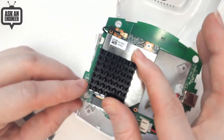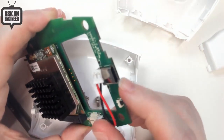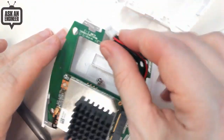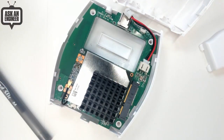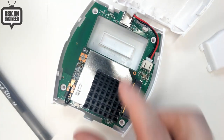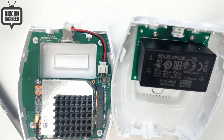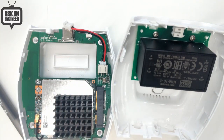It has a Wi-Fi module with antenna, and on the other side a LoRa plug-in module that gives you that eight-channel LoRa gateway. It's also USB-C powered, so if you don't want to plug it into the wall you can power it over USB-C. We got this set up in a couple of minutes with The Things Network — it's definitely the most affordable eight-channel gateway. It works with all our LoRa boards — Feathers, HATs for Raspberry Pi, breakouts, and shields — to connect sensors and transmit data up to The Things Network.